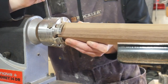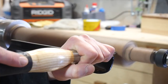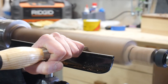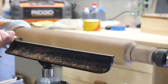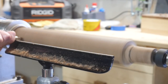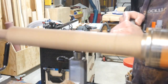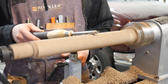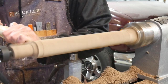Because this is 2 inch by 2 inch square stock, it actually fits right in the 2 inch jaws on my chuck, so I didn't have to worry about forming any kind of tenon. I put a live center on the eye socket itself, and that will just help stabilize the work while I'm spindle turning. I use a roughing carbide tool to slowly form the cylindrical surface of the handle. Even though I took off those edges, this still does actually take quite a while — probably the most boring part of turning. But I've got a nice chatter-free cylinder, which means I'm ready to start forming the profile.